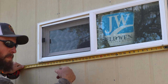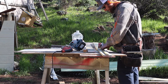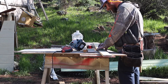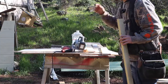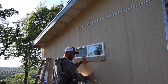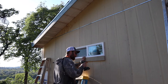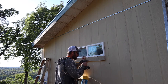This is more of a traditional basic exterior window trim. Measure your bottom first and make it tight. This board has a slight warp to it but we should be able to get it out. Square it up on the edges and find a stud — I know my studs are here because I have nails going up through there. This is concrete siding and it is somewhat brittle to put a nail through so close to the edge, so I will pre-drill this.